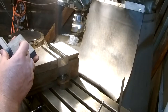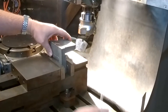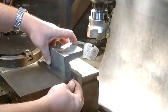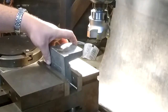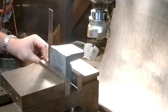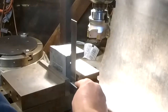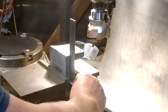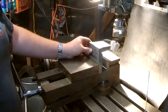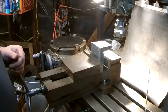That wire there is a piece of about eighth-inch aluminum filler rod for welding. I'm using that as a bolster bar to press against the backside of this casting to overcome any roughness in the casting or areas that are just not straight enough. I'm checking the parallelism and squareness vertically because there are no true flat square surfaces on this yet. Using my new vise handle I made in a previous video to crank it down.